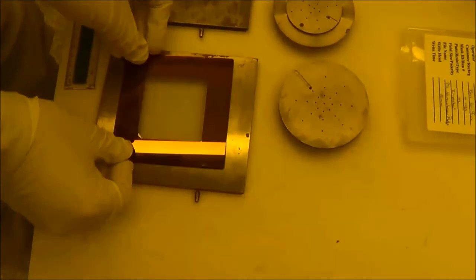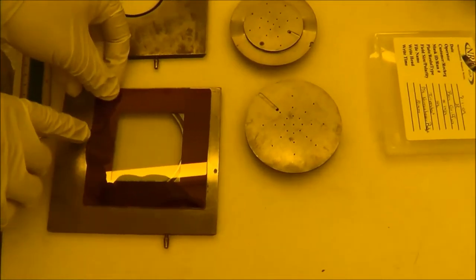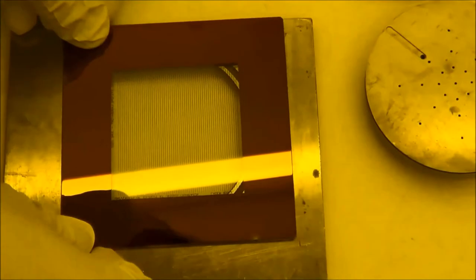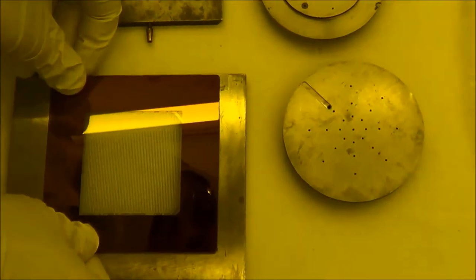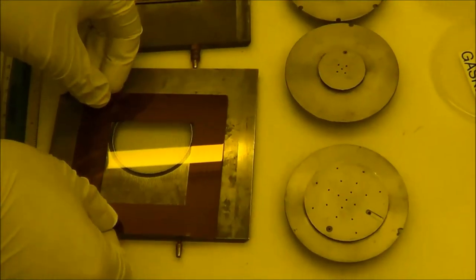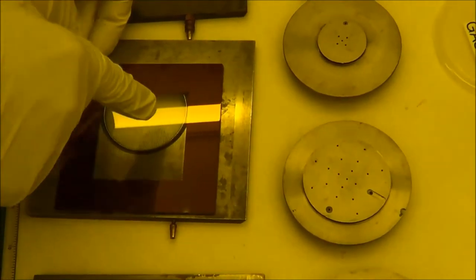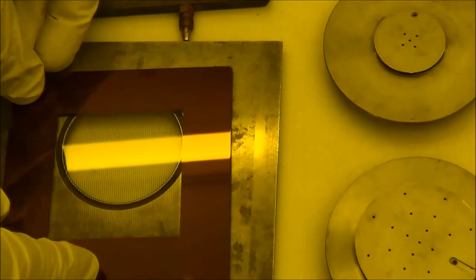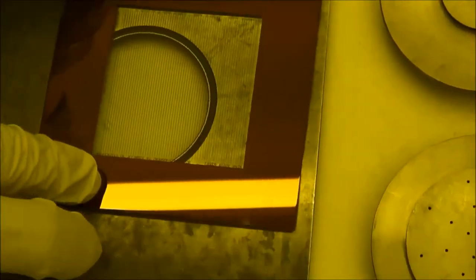This is a 4-inch mask. This you can hold at here. If you move too much and expose a hole or a small section of the vacuum, you will lose the force. That means the mask holder cannot fix your mask on there. And this one also can work for that. And you can move a little bit, such as if your pattern is on the edge of your mask, you can move a little bit.